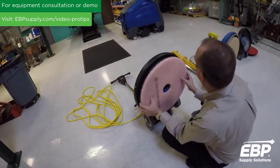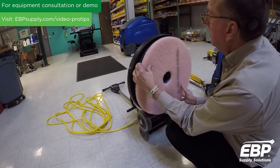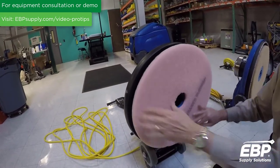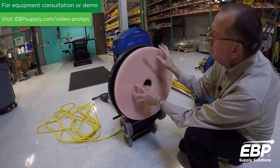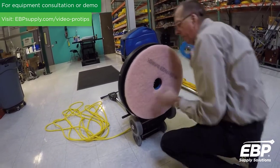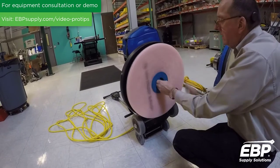Once again, this is the no-frills burnisher, but still, if you don't get the pad on right — let me just get it so it's offset — as I spin this you can see how that's wobbling. That is going to be a nightmare to run this machine, and it's going to make a lot of noise. So you really want to get this as centered as possible, and then you put the retainer in the same way as the other machine, nice and tight.